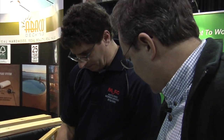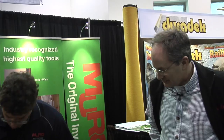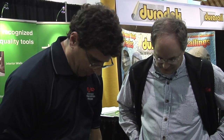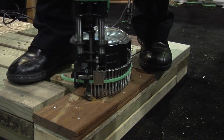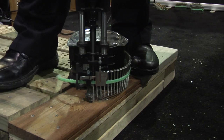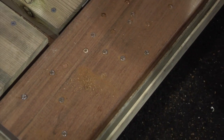I see you're drilling into pressure-treated, but how about something like IPE? You've got some IPE there? Yes. Miro has a patented screw called the ejector screw. It's really the only screw on the market that will perform in hardwood without pre-drilling. That screw went down nice and clean. Oh yeah.